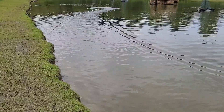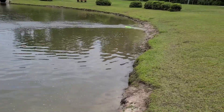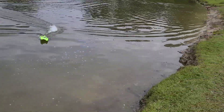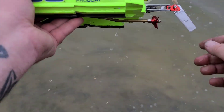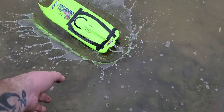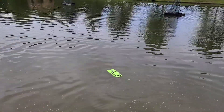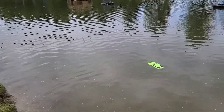A little bit of positive angle always helps. I just hit a damn turtle. I haven't run this boat in a while. I gave it some positive angle there. I've been doing that to some catamarans lately — especially ones that are wanting to hop real bad. If you put a little bit of up angle on your strut, it'll plant the boat.